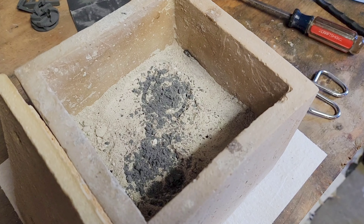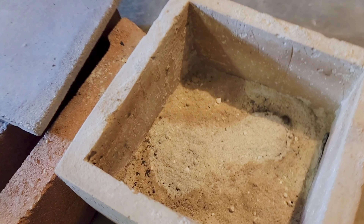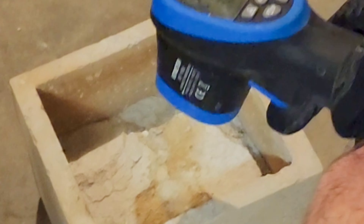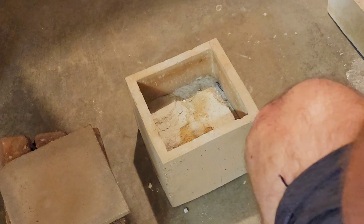Over time, this produced a yellowish hue to my ballast, and ever since sintering aluminum, my ballast has almost been purified to an all-white color. Given these are the last two pieces I have for this video, I'm hoping to see either a stronger end result or no difference from the prior flux-only sinters, in order to rule out zinc as a benefactor to success.